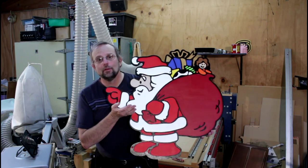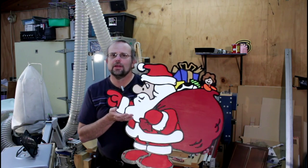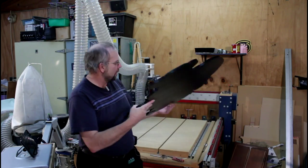Well, I think you'll agree with me, that's come out looking really great. And as you can see from the video, it's really easy to do — no major piece of artistic skill required, just colour it in, basically. Now you'll notice I made mine out of half-inch plywood, or 12mm here. This makes it ideal for screwing to a fence, as I've done with mine. But if you want to mount it separately out on the lawn, as I've done with some of my others, then a little bit thicker plywood — somewhere around the three-quarter inch range, even a little bit thicker. The extra plies give it added strength and stop it from bending and warping under weather conditions.